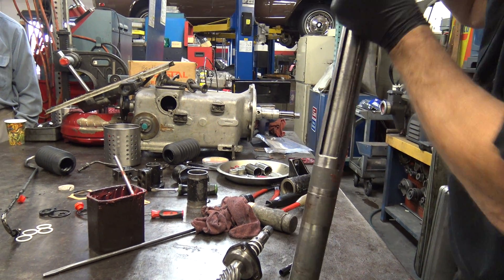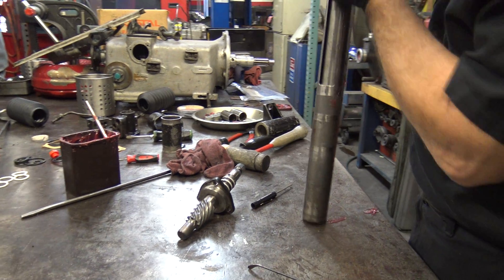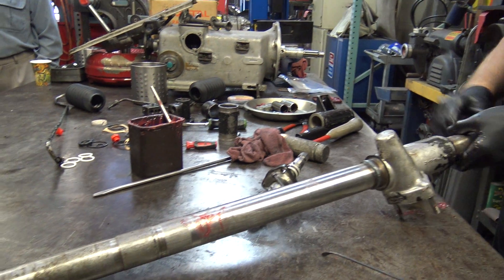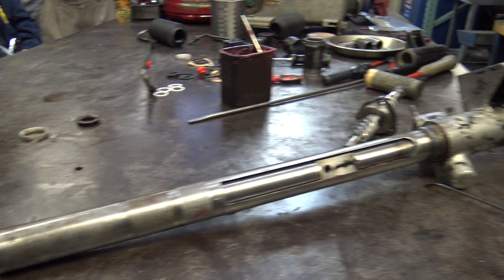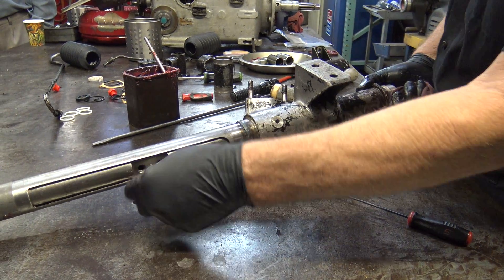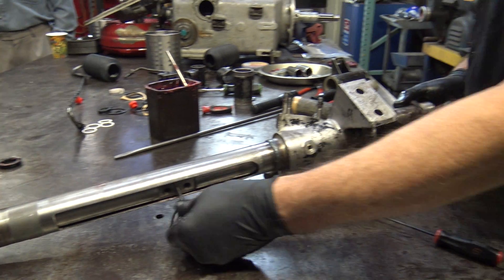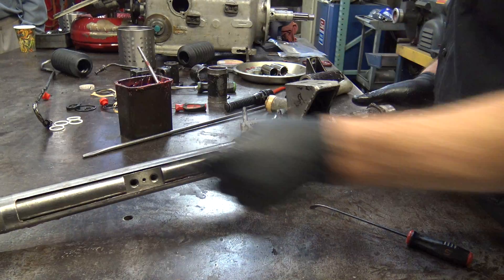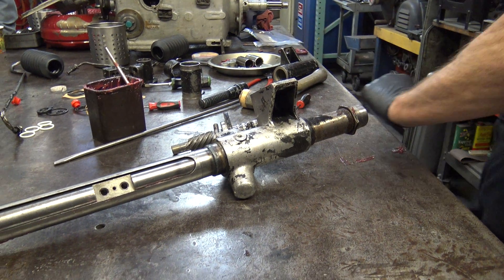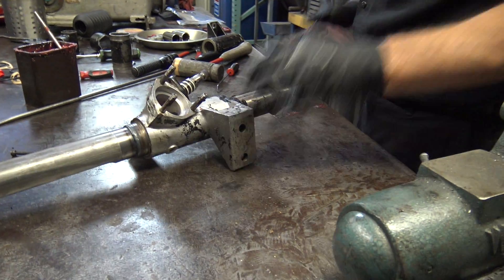You've got to watch out — don't damage those threads on the end. I'm not really slamming it. You can take that out now. Is it better to bang it like that than use a dead blow on the inside? From the outside you can do that. Typically I'll just do it on a block of wood or aluminum. I'm always worried about it kicking off, but a dead blow is just as adequate.